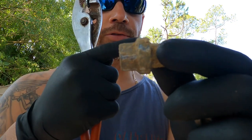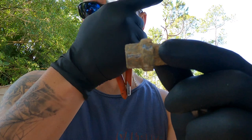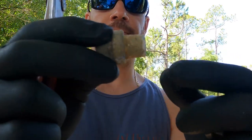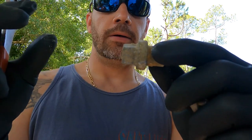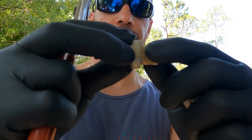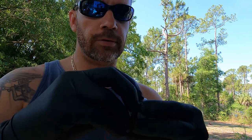All of this corrosion is created by the electromagnetic effect of the water inside the cylinder head and all the salt. It attaches to this anode so it doesn't get attached to your cylinder heads and stuff like that — wherever the salt water runs through. So get that out of there.